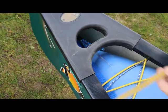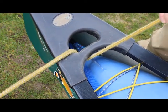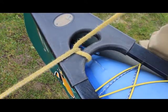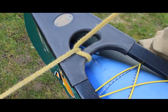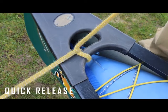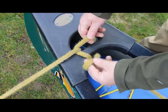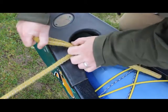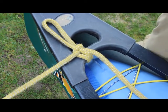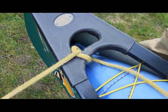I'm going to take the painter rope, pass it through the carrying handle, and at that point pull nicely with the painter — pushing the boat that I'm attached to, pulling it in slightly — you can hear the creaking going on. At that point I can then pass the rope underneath and lock it into place. The next part is to finish off effectively a clove hitch but with a loop in it — a bite — so that it's a quick release knot. I'm going to pass the rope through and under, then make a bite of rope, pass that through and pull that nice and tight. Leaving a nice loop and bite, and then a strand down that can be reached easily in the event that this thing needs to be broken down quickly. All that needs to happen is you pull the end of the strand and away it goes.